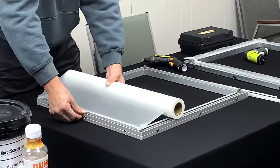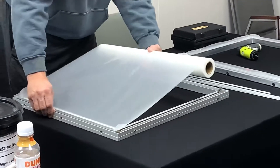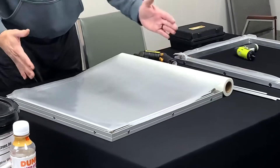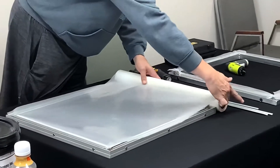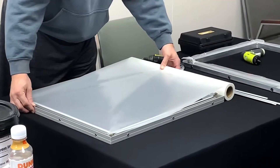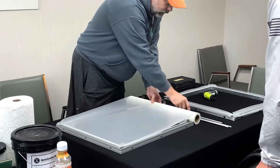That's enough to grab it right there. I'm literally under the edge of it — it's fine. Now here's the key: you gotta start this one square. If you start diagonally, you'll wind up like that and then you can bust the string. You're gonna get better tension if you start here, keep it tight at the other end — that'll let you know how square you have it — and now I'm squared up with the other end of the frame.